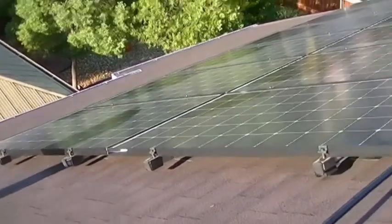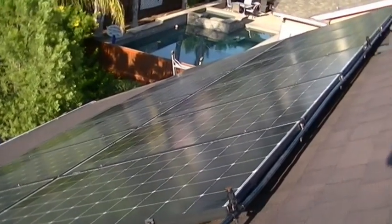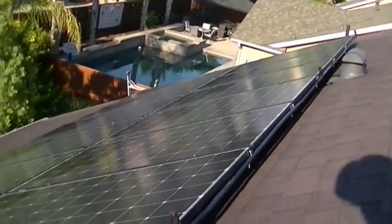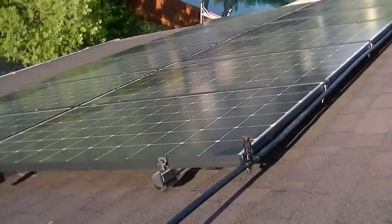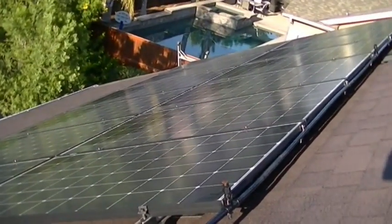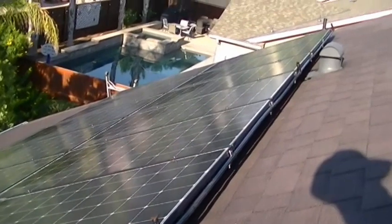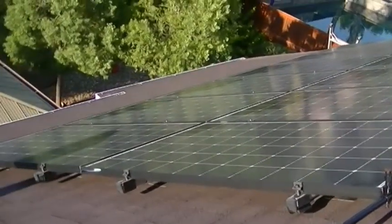I'm not going to move because it's slippery up here — now that I've set the sprinklers and it's wet, I'm being very cautious. This one here I've got a Van 12 all the way down. The three heads there are Van 12s and they've got a good overlap and a good washing pattern — not too much on the roof. The distance on this array is about 20 feet long and ten and a half feet wide, so I have 10-foot spacing between the three washing heads, giving a good overlap so that the corners and everything are covered very well.